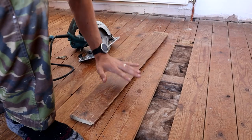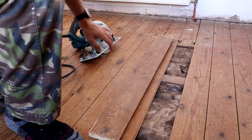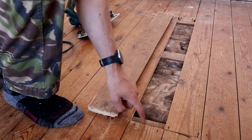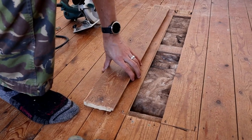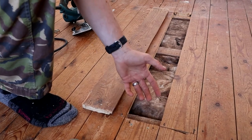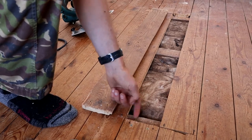If you can't find a floorboard that's already been lifted, you'll have to slowly cut down next to a nail, bit by bit, at either end, so you can remove the floorboard you want to remove. By taking it bit by bit it takes longer, but you don't end up damaging cables or pipes beneath.